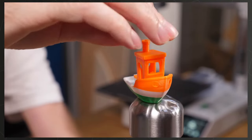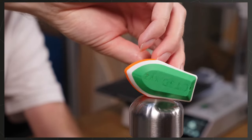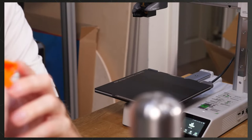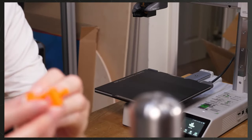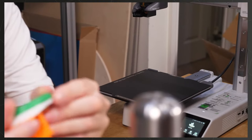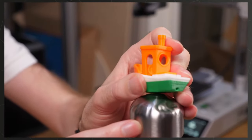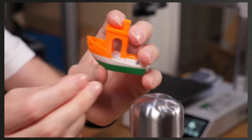Again, of course, only first impressions here today. First layer looks good. You can see the text nicely. Bit smooth around. You can almost see the text at the back, which you rarely get. You can see the infill a little bit around the sides. I can't remember how many perimeters it was doing. I think there might be some perimeter interaction with the outer walls. The seam is maybe not ideal here in the corner. It looks like it's a bit aggressive, but